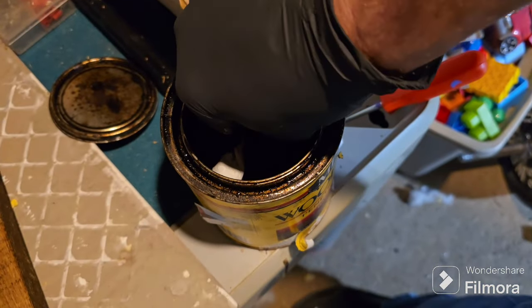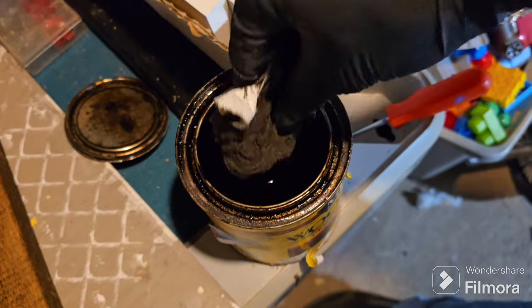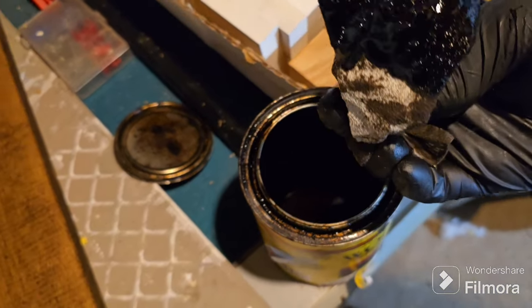We're going to do some staining on some oak boards we just bought, getting them ready for projects around the house. Got the mask on, got the gloves on. Using a rag instead of a brush because brushes need too much cleaning afterwards — this way we can just spread the rag out to dry and throw it away. Just spreading the stain everywhere, flipping the rag around to get more coverage.